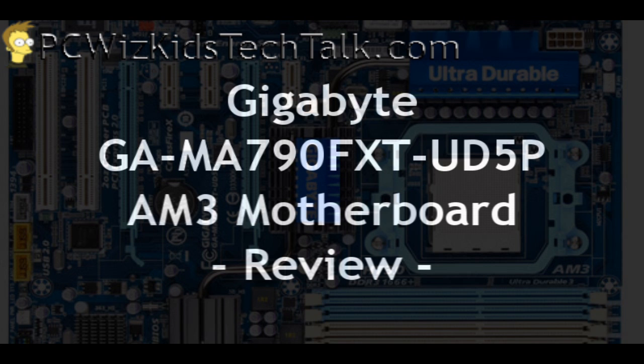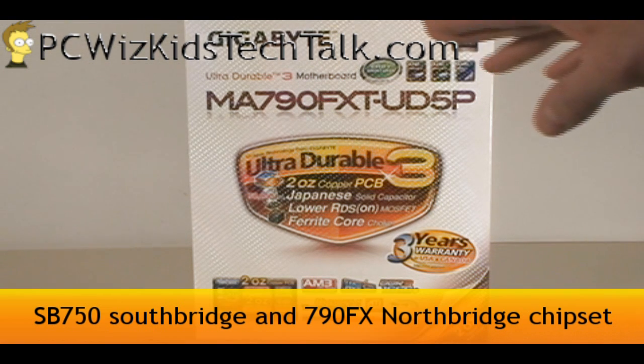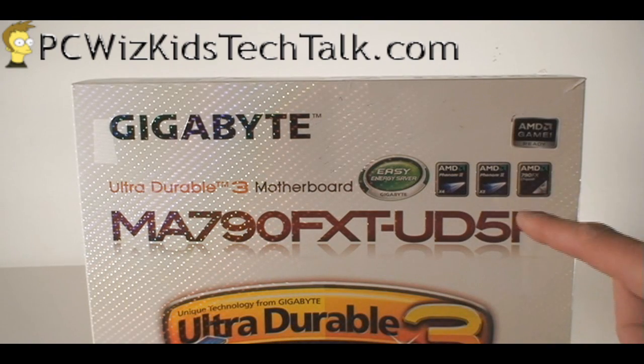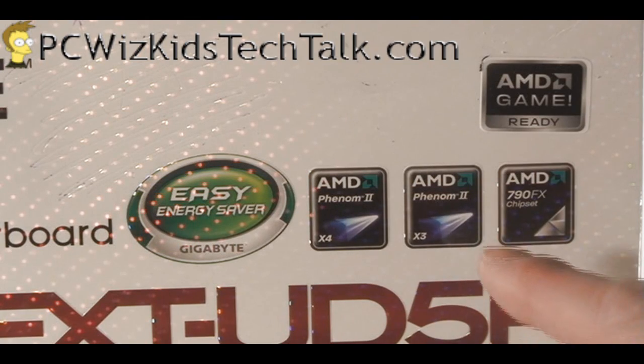Today I want to show you a premium motherboard from Gigabyte, the UD5. This one's an AM3 motherboard only, so it does not support the AM2 Plus CPUs. It has the 790FX North Bridge chipset and the 750 South Bridge. It's an Ultra Durable 3 model. Okay, so this one has a couple of premium bits in there that I'll talk about in a second.